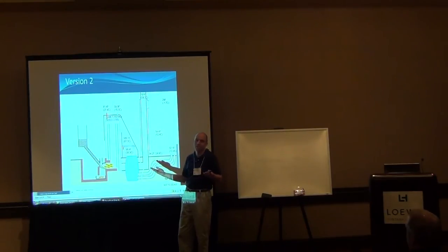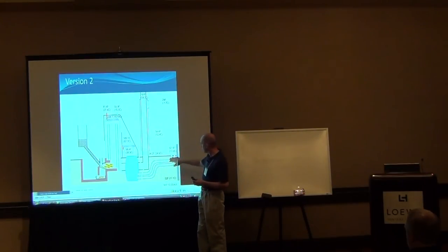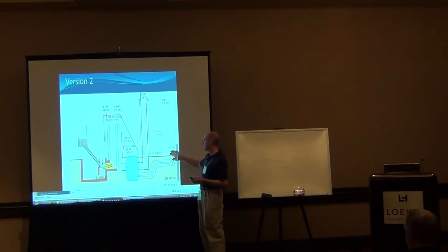The heat has no place to go. It's going to get absorbed into that radiator. So it gets pumped underneath here. Typically in Connecticut, our ground temperature is 52 degrees. It's funny, you get cold water coming out of the tap here, and it's like, ugh, this is hot water. We get nice cool water, 52 degrees coming out. 57 is the output temperature or the ground temperature if I've run this thing for quite a while.